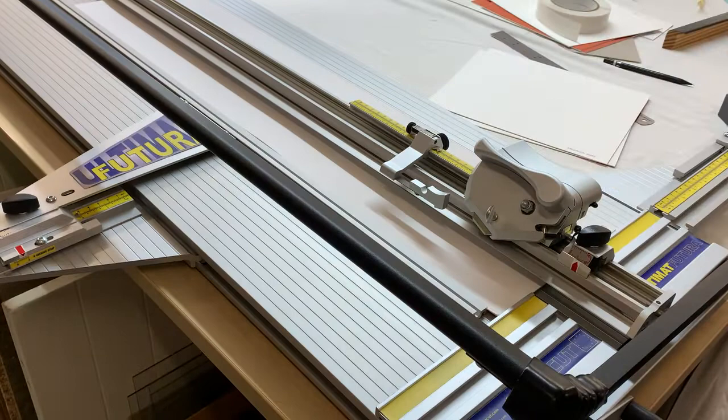To start with I need to cut two boards. The top board or the window mount to glass size, and the second board, the inner mount. In the demonstration I'm going to use a slightly smaller board. So if this board was 250 by 200 millimeters wide then the board underneath would not be 250 by 200 but 245 by 195 — in other words reduced in size by enough so that it just sits inside that top mount.